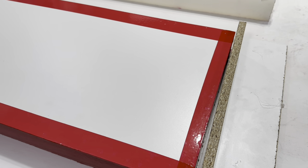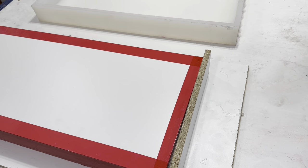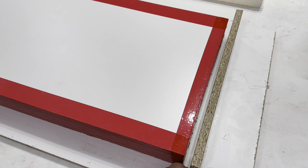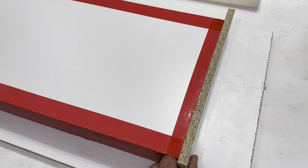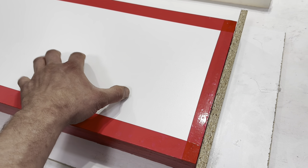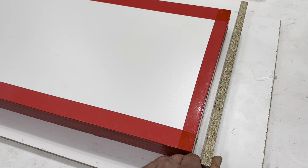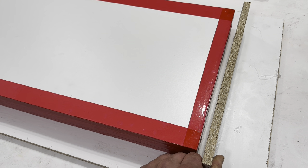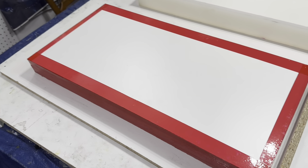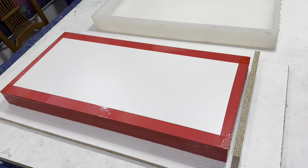This is the top side — the side you'll see me pour on. We also build the square framework around it, and what you want to do is try to leave a half-inch gap. I pretty much demolished my other frame when I took it apart, so I'm just using this as an example. You want to have the block all the way up against the rectangular block, shim it out, and then when you build your framework you'll be about half an inch away — that's where the silicone is going to go.